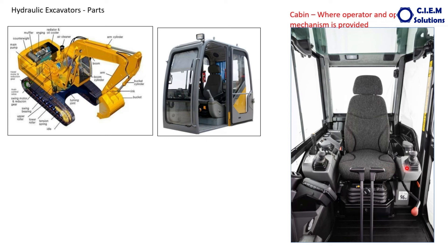Now, whatever is left — travel is left: traveling forward and traveling backward. These are the levers connected to the same type of valves; inside, valves will be there. These are called joysticks. The joystick levers operate the valves. From there, the pilot pressure goes and actuates the main control valve. I will be explaining that in detail anyway.